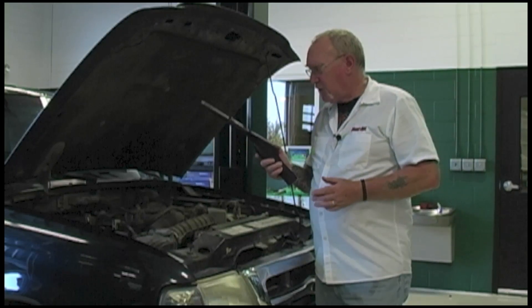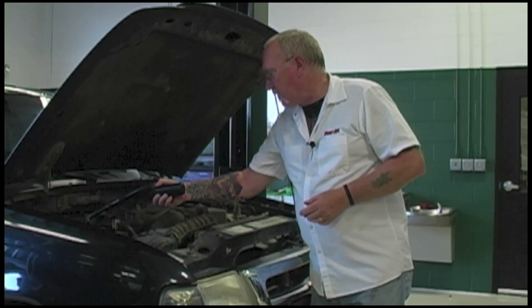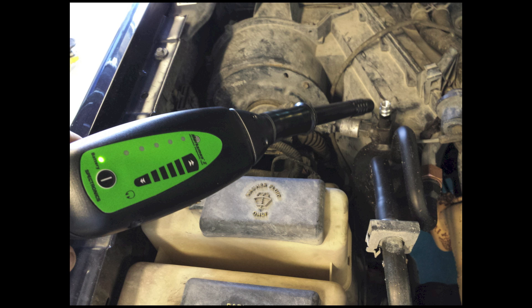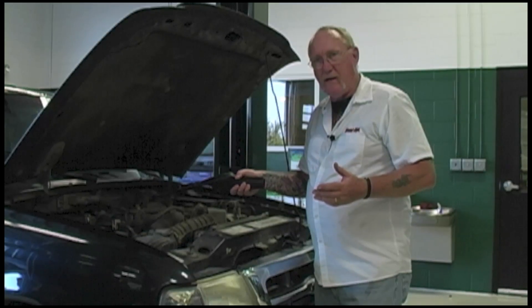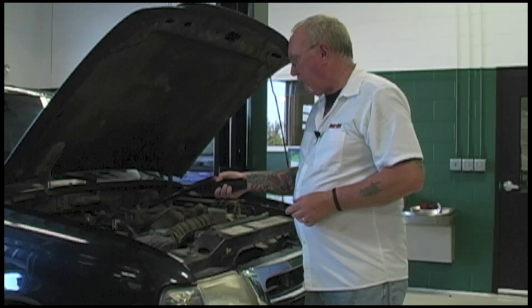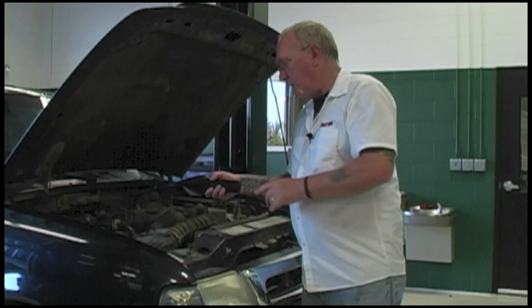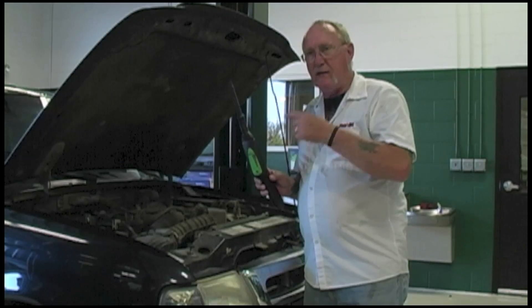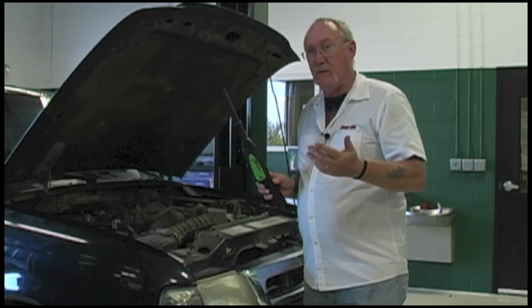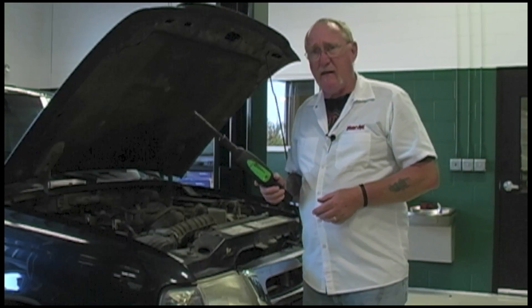So if you're looking for that really small leak, here's one other option. You get it up close — just like using the sniffer, very close to the sources. You can watch the gauge; as you get closer to the source, it's going to start getting higher. It's almost like those old metal detectors guys use at the beach looking for coins — same kind of principle. As you move it along, you're going to home in on that ultrasonic beep. There are also headphones available that convert the ultrasonic sound to a sound you can hear — if you hear a hiss as you pass by a leak source, that's what you're detecting.